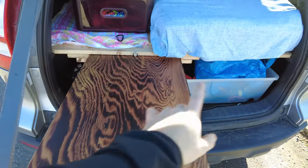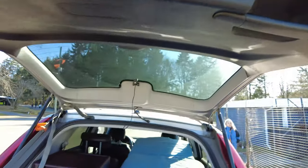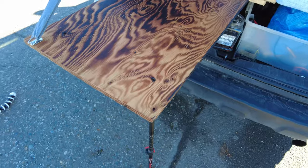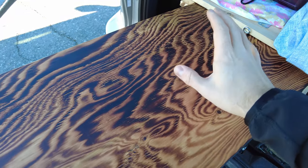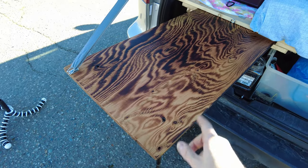A few design choices: I put the support on this side and not the other because that side has a handle up top I could have easily hooked a strap onto, but being on this side means when I'm cooking, splashes are much less likely to get on my bed. You can see the shou sugi ban finish and the mineral oil conditioner worked out really well. I'll link up that mineral oil conditioner in the description. I went with it because it's food grade — if I'm cooking on the surface or my hands are on the desk all day, I don't want anything rubbing off into my body. There are no VOCs with this; other sealants off-gas VOCs, which in such a small space would be very toxic.